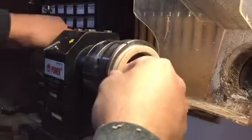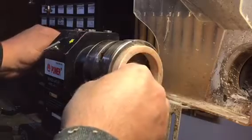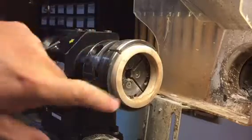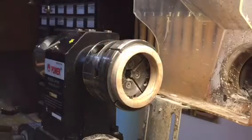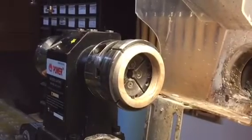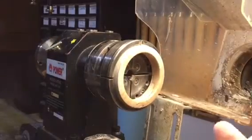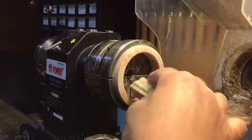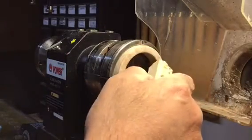That's pretty good. Like I said, sanding is kind of boring so I did that off camera. In the next section I'm going to show the exact same thing but I'm going to reverse the jaws on the chuck so that I'm holding it from the inside, not the outside, so I can finish sanding the outside. Before I do the outside I'm going to finish the inside first — I'm going to use some HUT Perfect Pen Polish, a friction wax polish — so I'm just going to burnish the inside and then flip it over to do the outside.